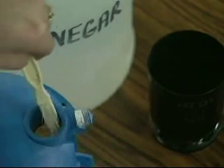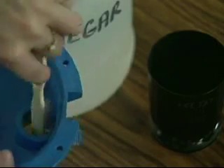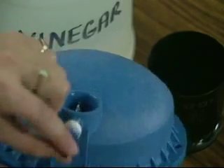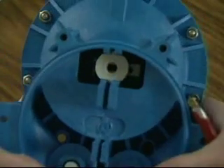Soap alone will not work. Be careful not to scratch the sidewalls, as this might create a leak. To remove crystal or chemical buildup on the chemical injection port, push a 3/16 inch drill bit back and forth through the opening until all obstructions have been removed. Be careful not to push too far, as this might damage the inside of the pump insertion opening.